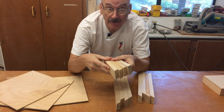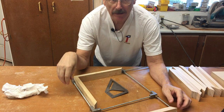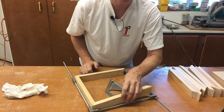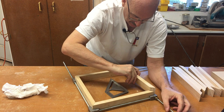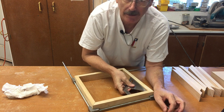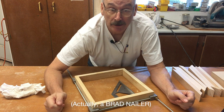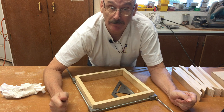Now I've got my three sets of 12-inch sides and my three tops, and we're ready to glue up. I have a lot of different clamping options here in the shop, but for small pieces like this, especially when I'm doing repetitions, I like to use this picture frame clamp. It's a pretty simple one that just works off threaded rods, and it lets me put in my pieces and operates kind of like an extra set of hands. I keep a square handy to check things just before I tighten it up.